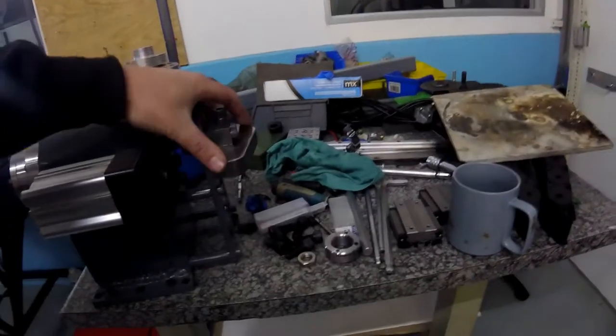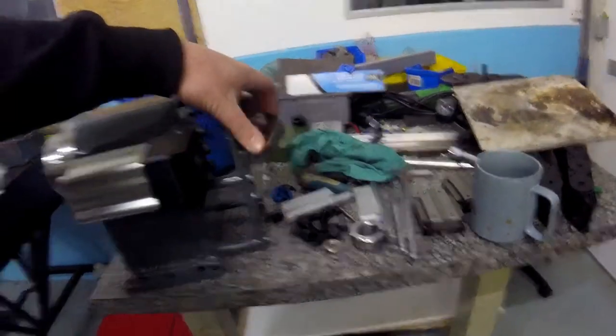My cylinder is now in pieces. I am shortening the shaft by 10 millimeters so that I can get full stroke over here, so that can come all the way down and then pivot up. And then I'm going to grind that shape, like a dome, but only in one axis, so that my contact isn't point contact, it's actually a line that's contacting my push bar.